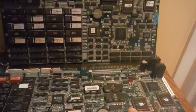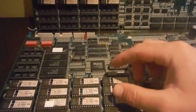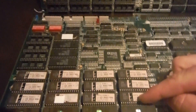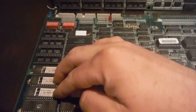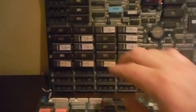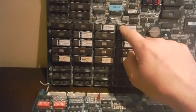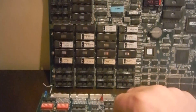There are some slight differences and I'll explain how to change them back and forth. The first thing — things that are interchangeable — is U-122 all the way up to U-133. These three rows of ROMs are the same for both boards. They're interchangeable; I can switch these out and it won't affect the gameplay at all. Those 12 ROMs from U-122 to U-133 are interchangeable.